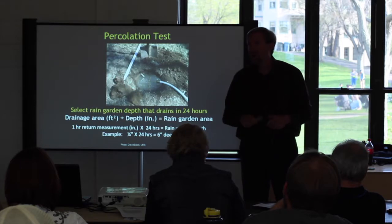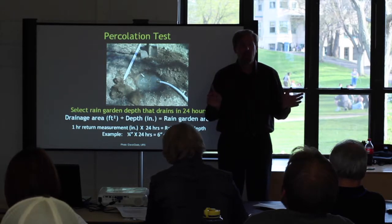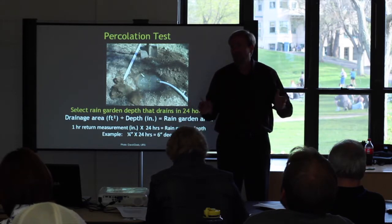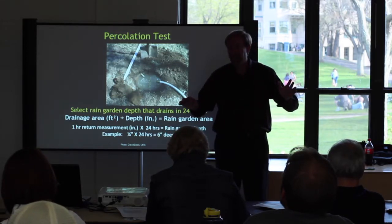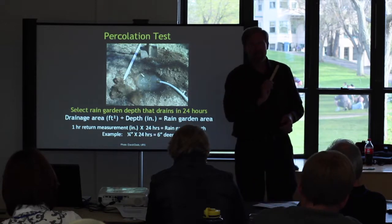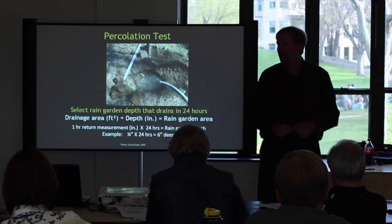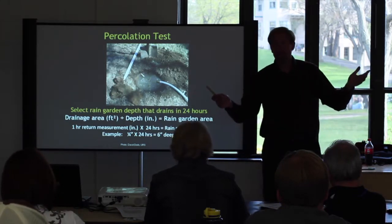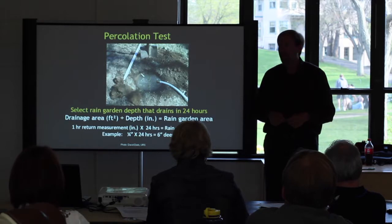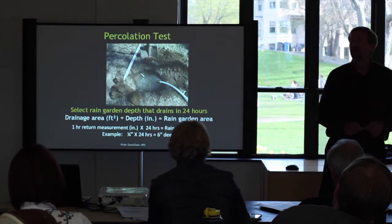Okay. So at this time of year in the spring, I would say no later than June 1st, I would go out, dig a hole, and fill it and test right away and not worry about it. After June 1st, and I'm just making this up right now, by the way, I would fill up that hole 2-3 times before I measure. Now, to get to your question, if the ground infiltrates a half inch an hour, how deep do you make your rain garden? 12 inches. Because a half an inch times 24 is 12 inches. So you're going to make your rain garden 12 inches deep.